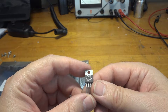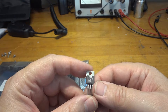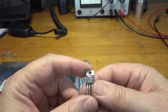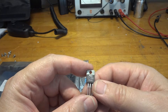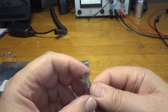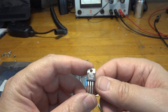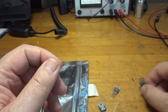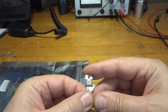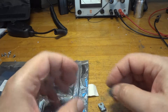The 2SC1306 is basically the same transistor as the 2SC2166, also a very famous transistor from CB radios of the 80s and 90s — and that one is also faked on eBay. The 2SC1306 is drop-in compatible with the 2SC2166, and we'll show you that too. So you don't have to go to eBay for Chinese fakes — you can buy the ones that we have here.